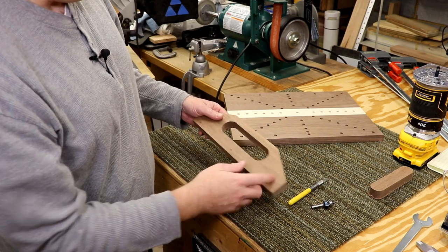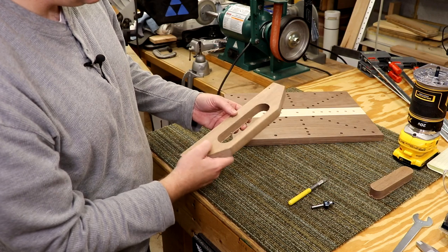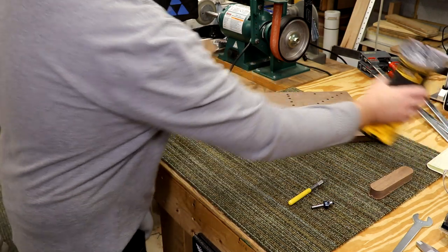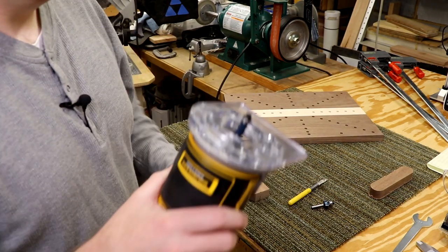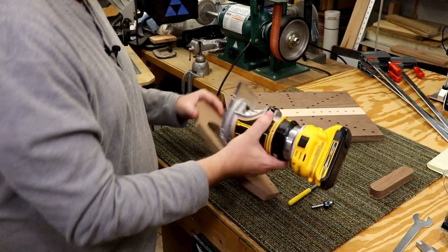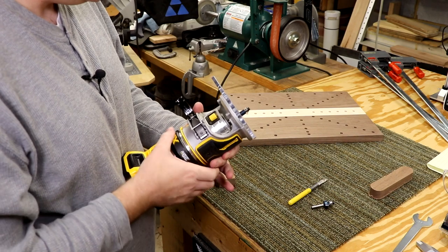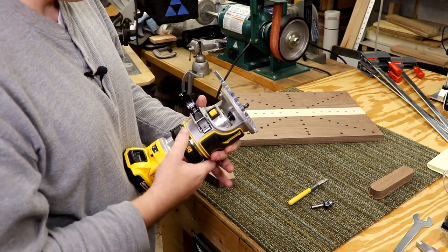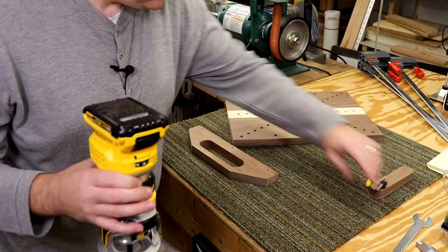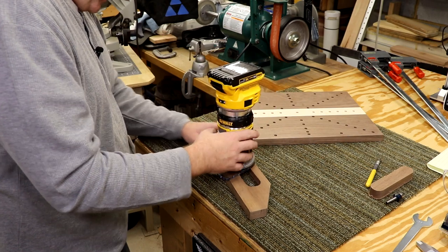The other one's still sitting on the machine — it just finished cutting. What I'm going to do is kind of cheat here, and actually it's going to work out really well. I'm going to use a flush-cut trim bit in my router and just follow around and trim this out. It should take care of it and make it nice and clean.